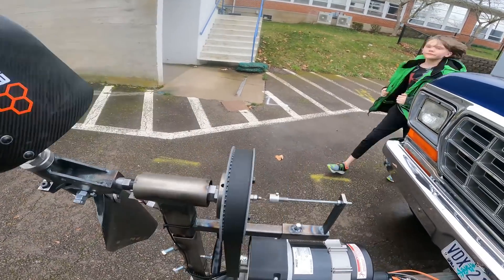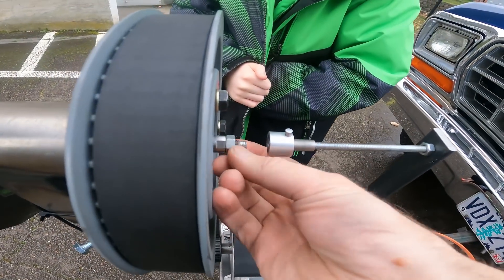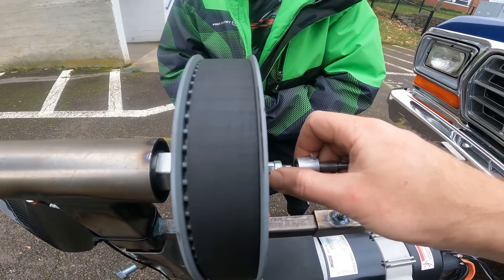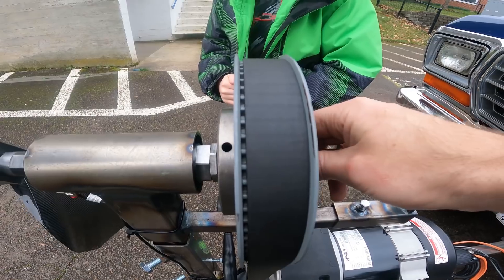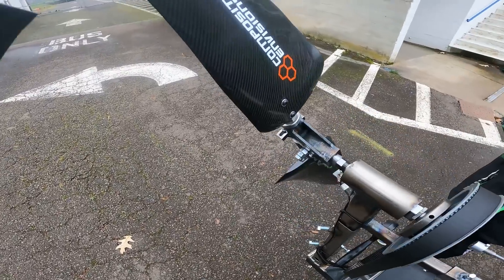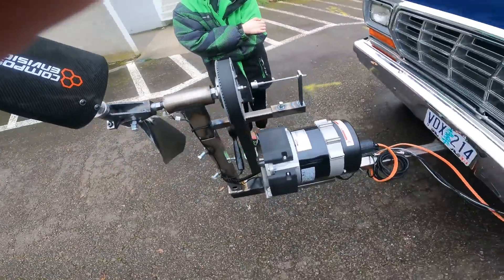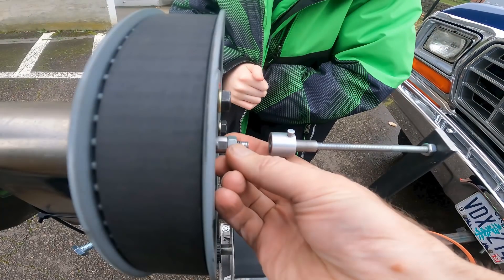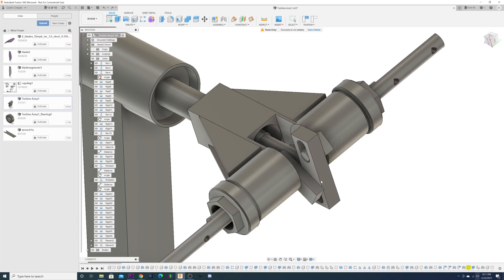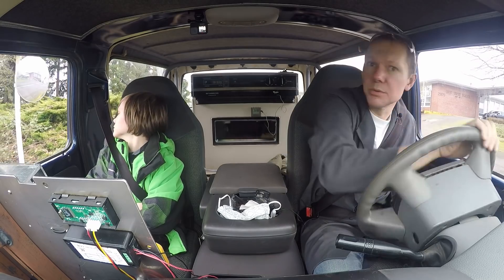Or so I thought — it's still free to move. A little pressed piece keeps coming out; this was light duty and I underestimated the forces on the blades. Something about the drag is putting way more torque on there and ripping the thing out. But wait — that joint failed from the rod pulling out. If we reverse the mechanism, we could make it push in instead. We've had a number of challenges this morning. We had to flip some things around so that the press-fit parts don't come apart. Cross your fingers that nothing else goes wrong.